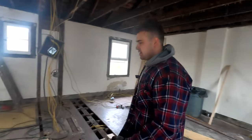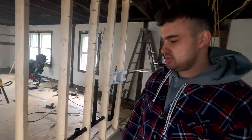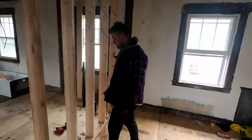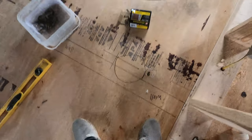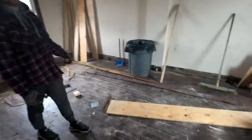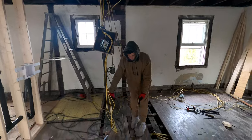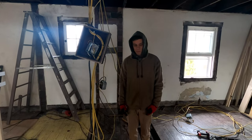We've been at it - our master plumber just took off. We got most of our drain lines ran; we haven't run our supply lines yet for the water because we're stepping it up to three-quarter inch - the existing was half inch - so there's going to be a lot more water pressure. Got our island placed out with a little new wall to help hold the counters and put our drains in. This drain is for the sink; the dishwasher is going to tie into that. We got our toilet plumbed up, shower's next. We're going past our last beam, filling this in with three-quarter inch plywood then putting plywood over top of it. For the wires, we're going to lay our base plate for our other bathroom wall and then run the wires back up through the wall so we don't have to fish more wire down to our box.